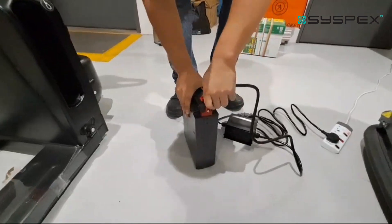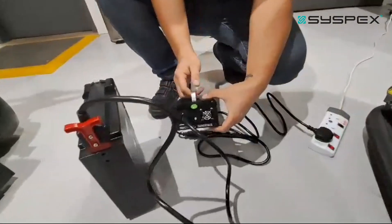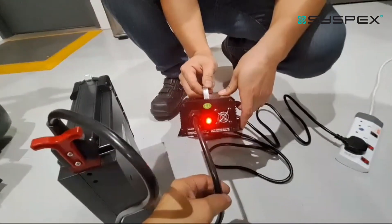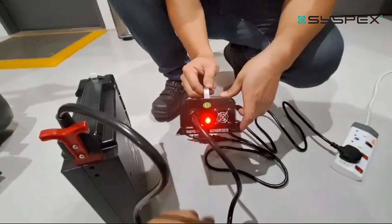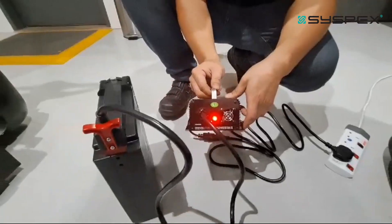Plug in the plug and turn on the power supply. Same as before — check the LED: if it's red, it's charging; if it's solid green, it's fully charged; if the LED flashes yellow, it means low charge; if the yellow LED is solid on, that means there is a battery fault.